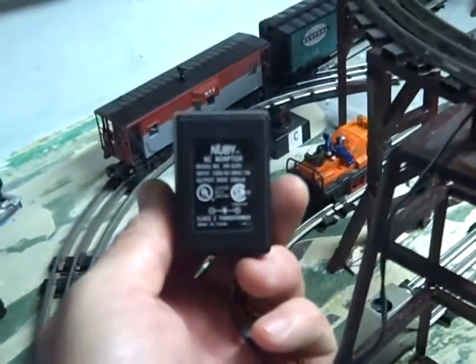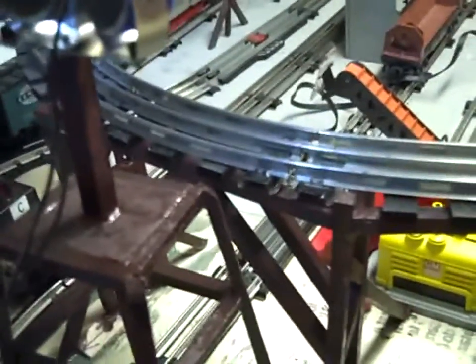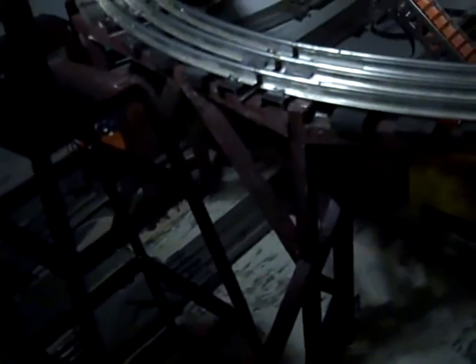I'm using an AC adapter, but it's gotta be 3 volts. If you try 4.8 or 4.5, forget it — you're gonna burn it up. Also, do not try to put a Lionel transformer on these because it's alternating current and it will just zap and burn them up. Believe me, I know. With the three lamps, they're not even warm. With one lamp it was getting a little warm because the milliamps are a little higher than what the little AAA cells put out.